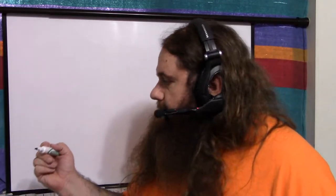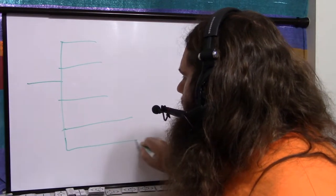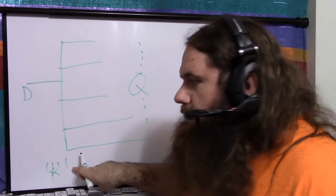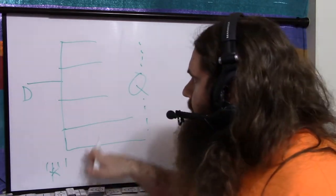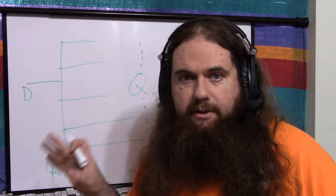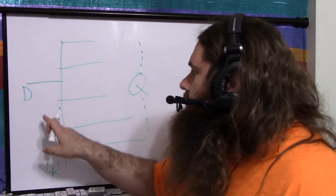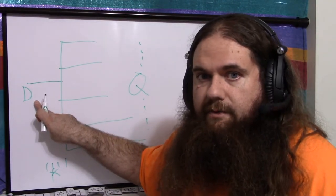A demuxer takes an input and provides an output to whichever one is selected. You've got address pins, you've got your input, your data, and your output queue. So address pins could be a number from 0 to 7, and there will be 8 lines. So the address pin says which line. Reset is high, which means every single bit is trying to reset to 0. So every one of these outputs is going to be 0, but writing is enabled. So for the specific pin that's being addressed, it'll act as a transparent latch for that pin.